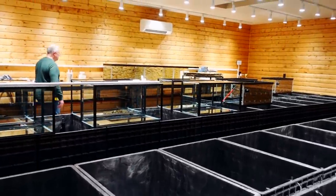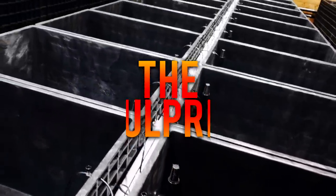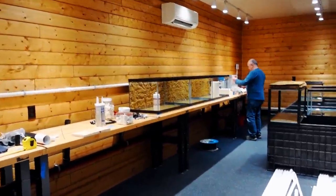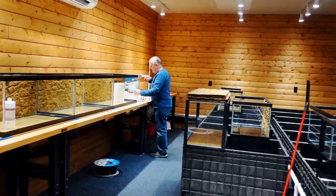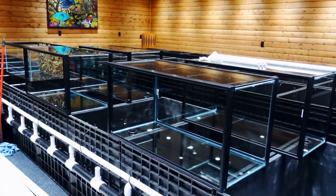It's only at 20% right now. Is that 100%? 70%. Once it gets all the air out it'll be super quiet. This one didn't have any noise when you turned it on — when we very first fired it up there was air stuck in the valve. Let's run it up to 100%. Two days later — we now have water flowing. The culprit of the problem with the loud sounds was air getting sucked in from other manifold parts, and that should go away when we finish.